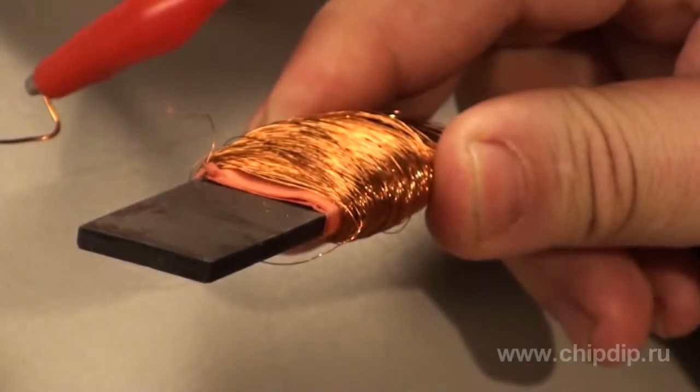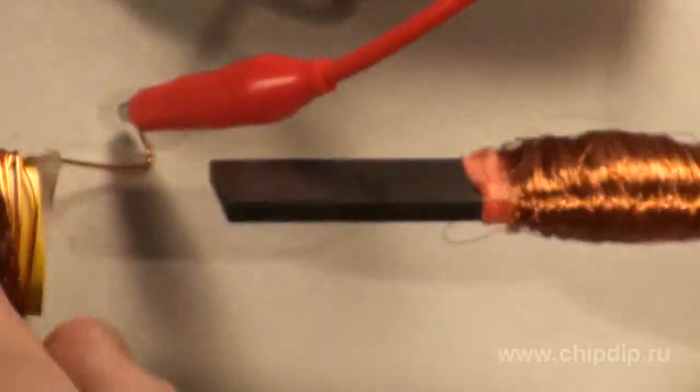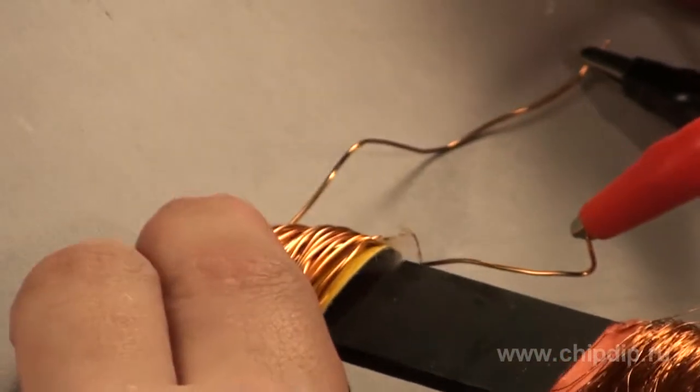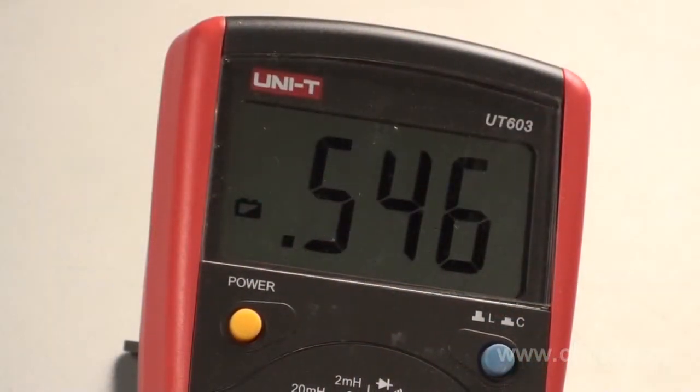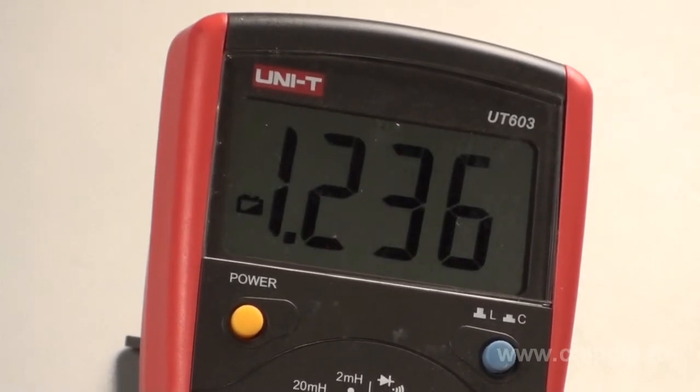The high permeability of the core material, and the closeness to the coil winding, determine the overlap ratio of the ferromagnetic variometer. If we use a ferrite core, we can obtain an overlap factor of 25-30 or more. It is advisable to select cores which have 5-10 times greater length than the diameter, and the core diameter should be less than the outer diameter of the coil by 0.5-1 mm.